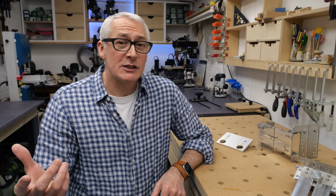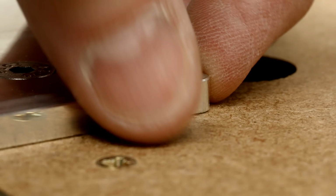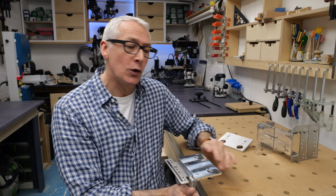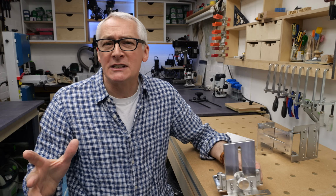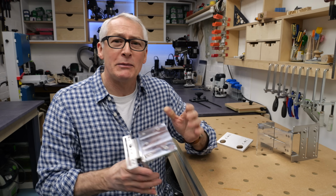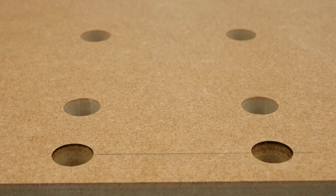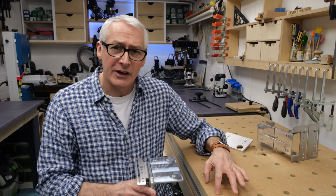The drawback of this approach is that the hinge and front rail support mounting plates actually sit on the bench top, so that 6mm thickness of the plate might get in the way or reduce the depth of cut from front to back. Now, I'm not privy to the design decisions or philosophy behind the Benchdogs design, but I'd imagine this is why they've opted not to use the existing grid of holes, but instead locate the hinge and front rail support off a pair of holes that are closer to the edge of the MFT top.